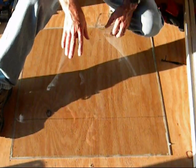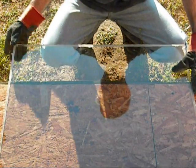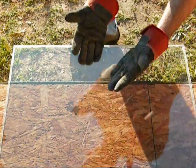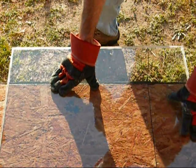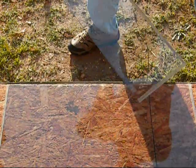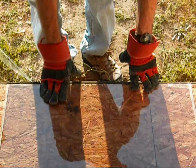Okay, so now it's ready to be snapped. I like to use the shed where the doorway is here because it's a pretty hard surface. Go ahead and sit the line that you just cut right across the threshold there. I always wear gloves — definitely — and make sure you always wear glasses. Go ahead and stick that over on the floor there, and you get a pretty nice clean cut. You might be able to use the offcut for something else, some small project, a picture frame, something like that. So I'm going to go ahead and repeat the process and do 20 inches on that.